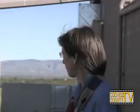But the class came and we put in the platform. The grant paid for this 2,500-gallon tank. The class put that in. We put in the conveyance system. This is what's called an active system. A passive system is where there isn't a collection container.